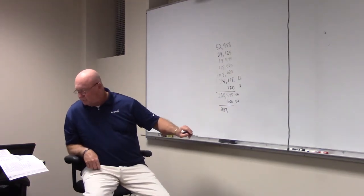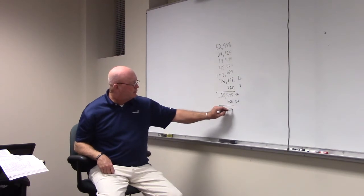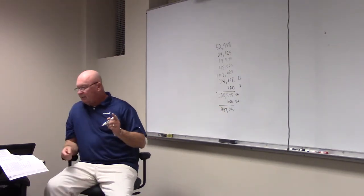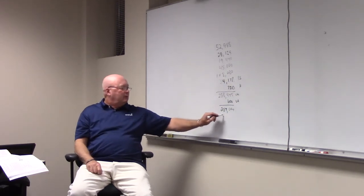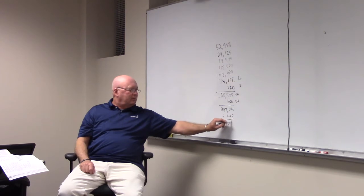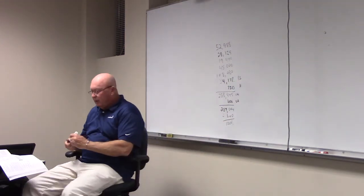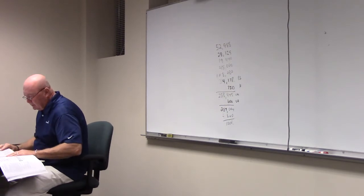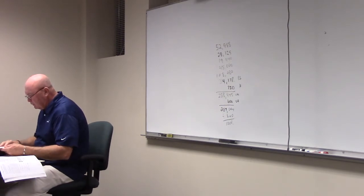45? Mm-hmm. 289,045. And we're going to do what with this 289,045? Divide by 240. And we're going to come up with how much? 1204. 1204. And then we're going to select our service size. We're going to go to where? 240.6.